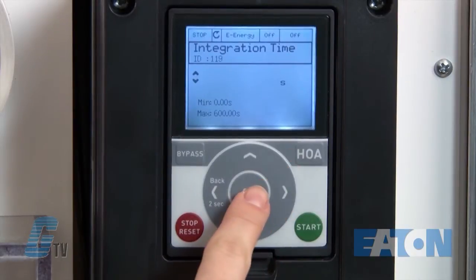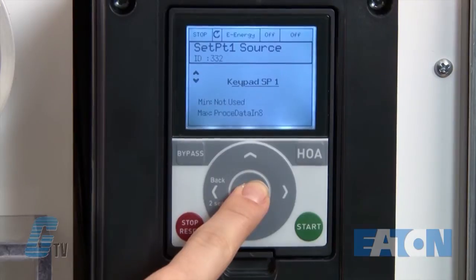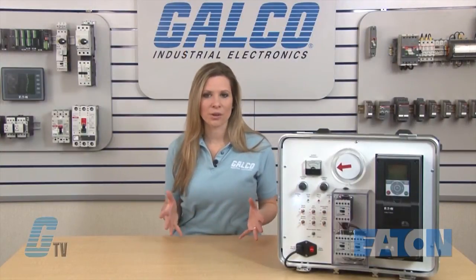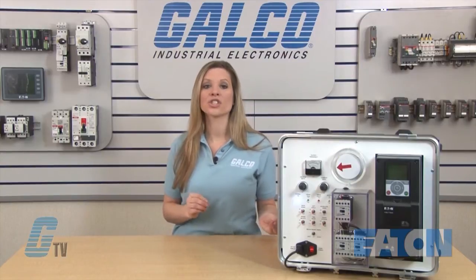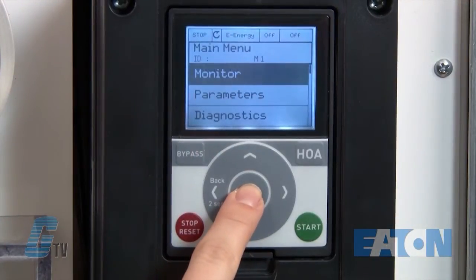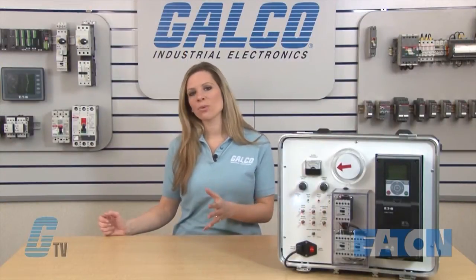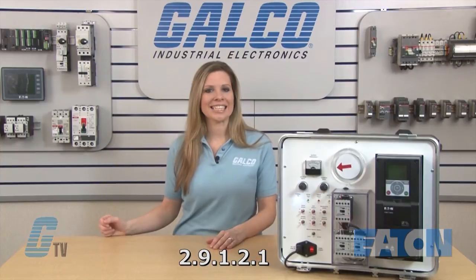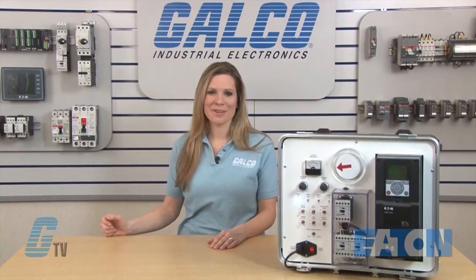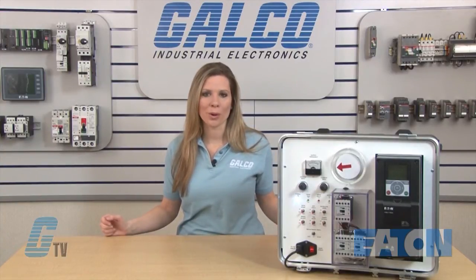I will keep the gain at 100% and keep the integration time at 1 second. I will also keep the set point 1 source on the keypad. The display should show ready to start. All the settings I plugged in can be changed later or I can hold the back key to go back. I will push OK to advance to the main menu. I will need to plug in my set point. This is parameter number 2.9.1.2.1. Knowing the number can make navigation easier by following the parameter number in the upper right corner.